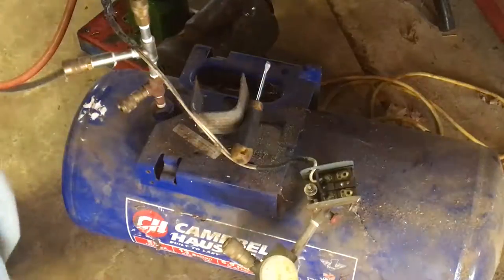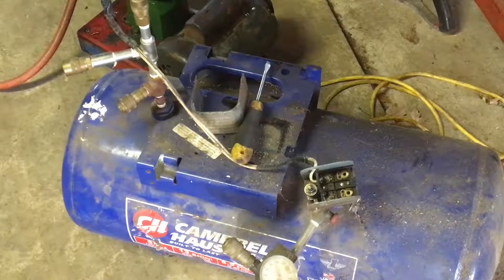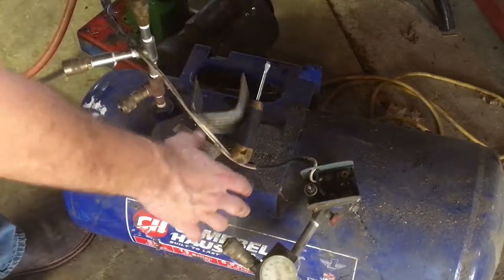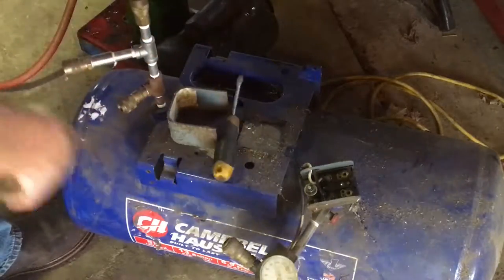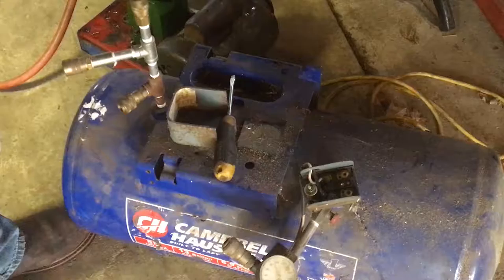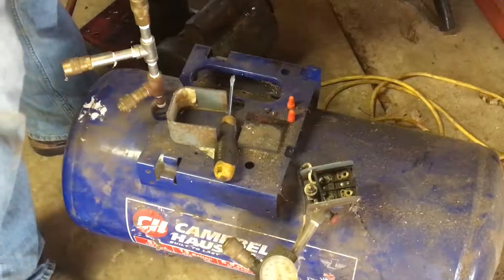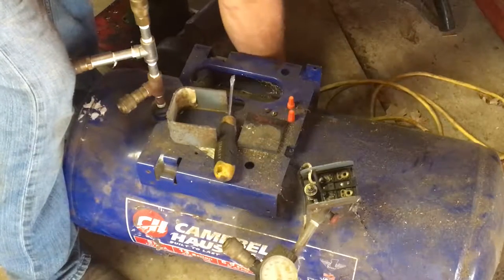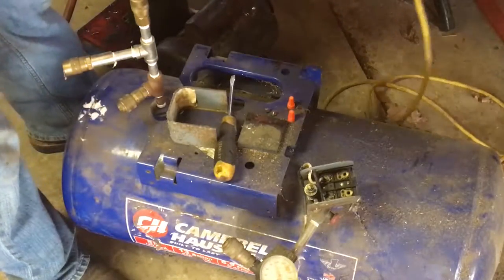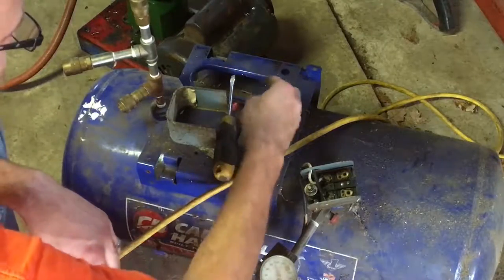Okay so I ended that in a bad spot. All I did was show you wiring it up to the motor itself — it's very, very important to note this could be pretty dangerous if you didn't know any better. Very important to note: this needs to be wired through the pressure switch on the tank. Wiring it straight to the motor like that — if you run it like that it's just going to pump and pump and pump until you're over pressure, or it shuts down because it's too hot and can't handle the pressure. What you have to do, instead of just feeding these leads straight to the motor, is bring them into this pressure switch here and then feed back out to the motor from there.